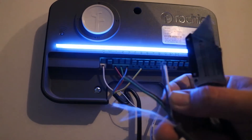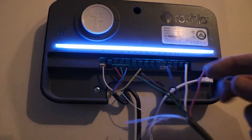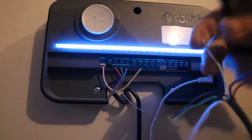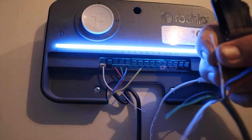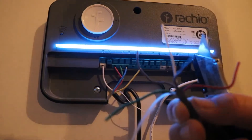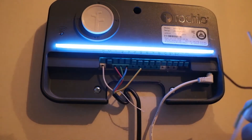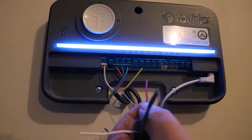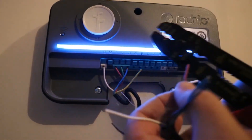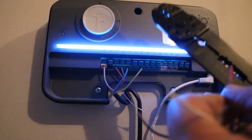The wire I used has five wires, three colors plus one. Each one is in its own color — one wire per station and one for the soaker system. The white wire is going to be the common. It doesn't really matter which colors you use for each station, but we'll use red, green, and blue. Stripping these off is pretty easy — get needle-nose pliers or stripping pliers, put it in the right gauge. Let's go down to 18 gauge.